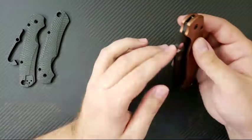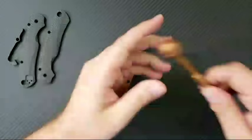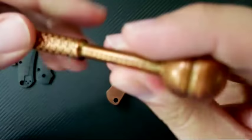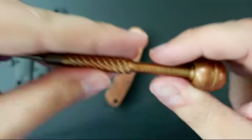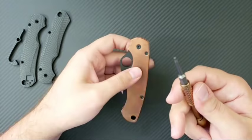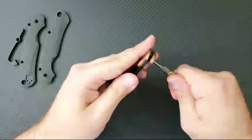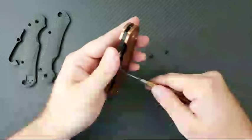You're going to need your drivers. This is the Brian Fellholter Screw-It — it says Fellholter on one side and Screw-It on the other. It's a very great screwdriver. It looks like I've got a T8 loaded, which will work fine for the pivot here, though it may actually be a T10, so be careful. The pivot is T10, but it did unscrew for me with the T8 — I'm glad I didn't strip it.